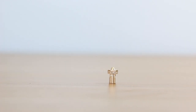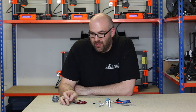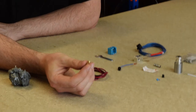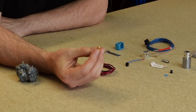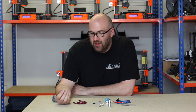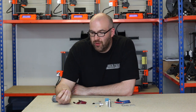So we start from — I think 0.2mm is the smallest size you can get — all the way up to 1.2mm, and that's the hole in the very tip where the filament comes out. You'd want to use a larger hole if you were wanting to do larger models, basically, as it's a lot quicker to do, and actually it's stronger because there's a lot more material going into it.